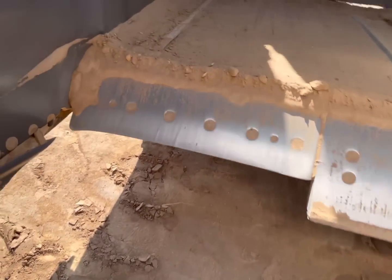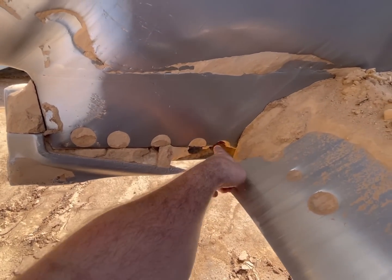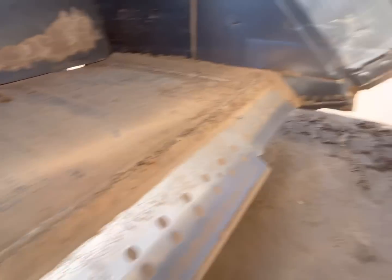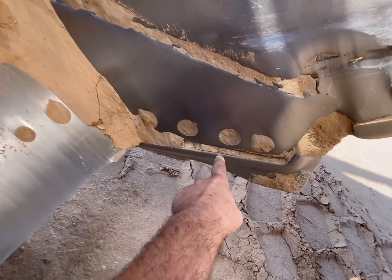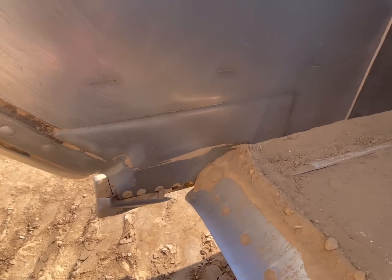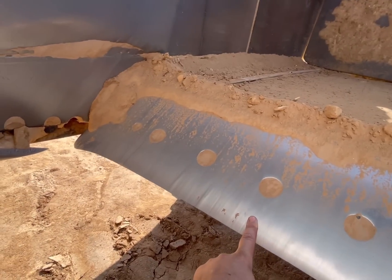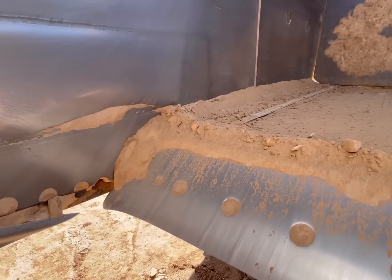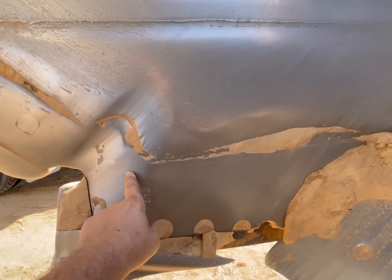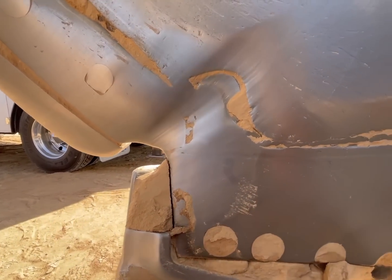And the reason it's bending, well, it's wore out. You got, you know, pretty much no bolt hole, a little bit of a bolt hole. And you can see how it's supposed to be, where it's got meat below each bolt hole. So basically, what we gotta do is we gotta take off the router insert. We have to take off this cutting edge because we have to get all the way in that crack. And I'm pretty sure this one's been done before because you can see that discoloration in the steel. That's a weld right there, a little darker, that darker spot.